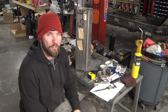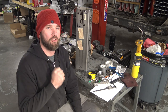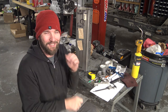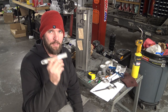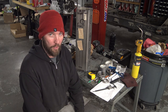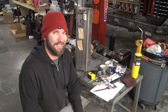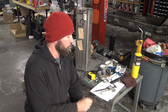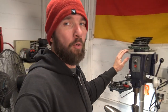The key to drilling stainless steel is you really don't ever want to try to drill it by hand, especially larger holes. You really need a drill press or preferably a mill with a lot of downward feed pressure at a very slow speed, because stainless work-hardens pretty quickly. If you take a normal cordless drill and just squeeze the trigger and go to town, you are definitely going to work-harden the material and smoke the bit. I've drilled stainless before with high-speed steel, but last time I tried a hand drill I ended up work-hardening it, and after that you need a carbide bit to remove the work hardening because it becomes like diamond-hard.